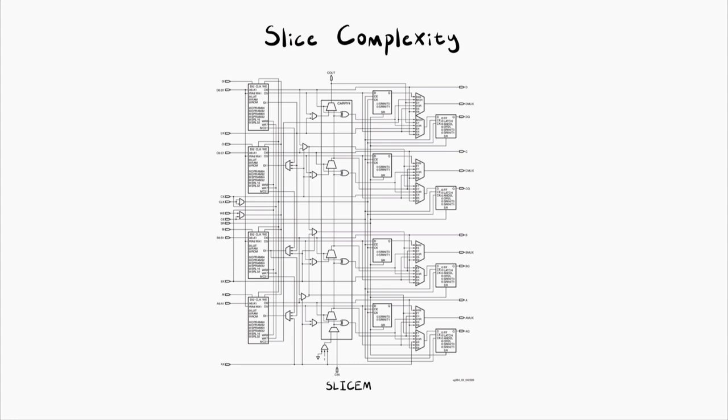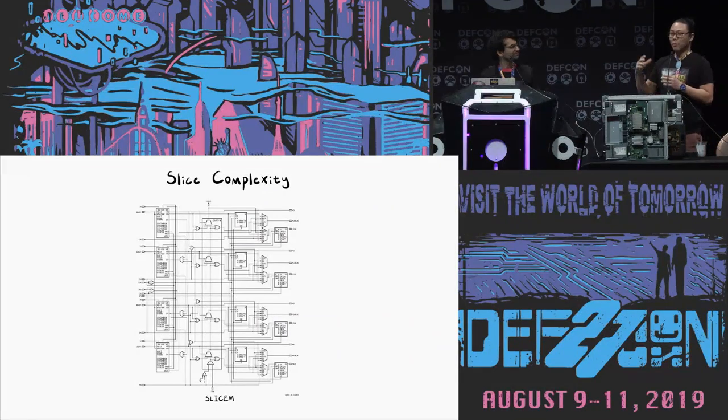Right, because there are so many little nuances, and all of the innards of this are almost always in commercial FPGAs kept as a secret. This is a proprietary thing. They give you a toolchain that generates, from the hardware description language, the bitstream that configures their vendor-specific FPGA, and it will work, but they will generally never tell you any of the internals of how that bitstream is read and what that bit actually does. But you have to know all of this stuff about the components, and you kind of depend on the fact that the magical toolchain will give you the bitstream that will magically configure this hardware to do what you told it to do through VHDL or Verilog.